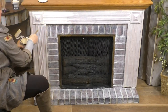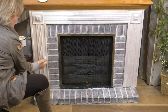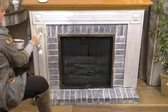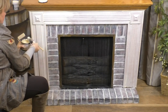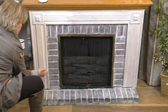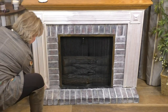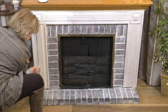She's doing that brush and roll — put on the paint and roll right through that wet paint lightly with your dry roller. Main thing: dry roller, wet paint. Don't put paint on the roller — put the paint on your brush and go over it with a light dry roller. We've also done a coat of whitewash antiquing gel on the brick and wiped it back, exposing some of the brick to give a tonal look. In a minute we're going to show you how to deepen the tone of the wood on the mantel, and we've got a fun finished plan on top of the Linen.